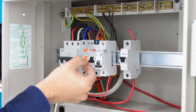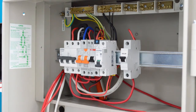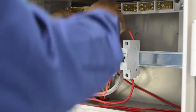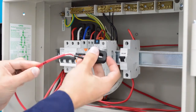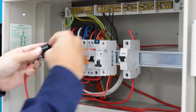I've identified using my multimeter that the solar feeds into the white phase. I have made this phase the first current clamp to be clamped over the active and I've also powered the unit from a similar circuit that is also fed off the white phase. Using the phase rotation previously discovered, continue to place current clamp two on the next phase in rotation. In this case, if it was a standard phase rotation it would be the blue phase. Now install the last mains current clamp number three on the last phase in the rotation — in this case, in standard rotation, the third will be the red phase.